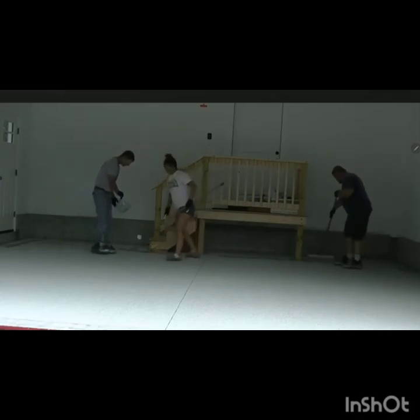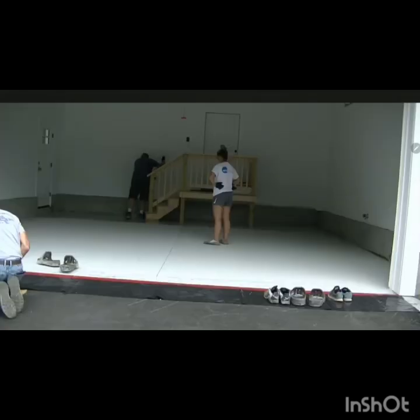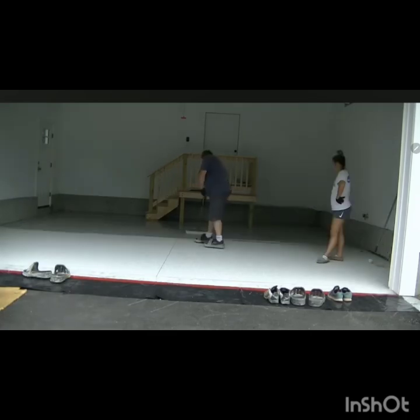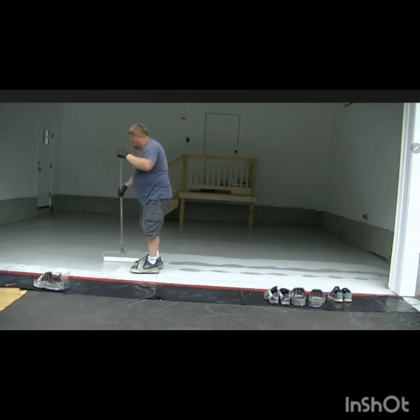And this last coat has different options. You can use just a clear epoxy, it's fine, but don't forget, after 6 months usually they turn yellow because they are not resistant to UV. But the product that we use is actually resistant to UV, so it will not turn yellow. It is more durable than clear epoxy, and also easier to roll, and also it's resistant to chemicals and salt during the winter. And as you see, it's a little bit more shiny right now, but that shine will go away, so you do not need to worry about it.